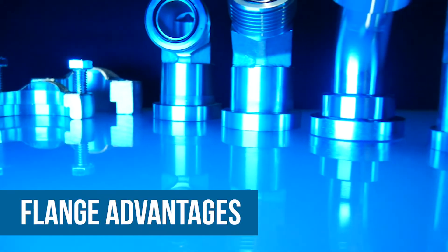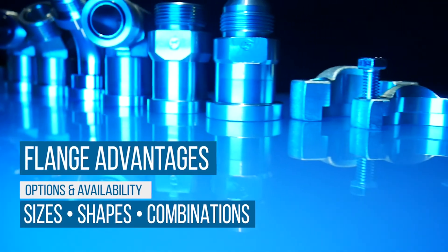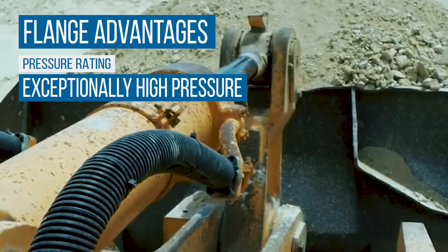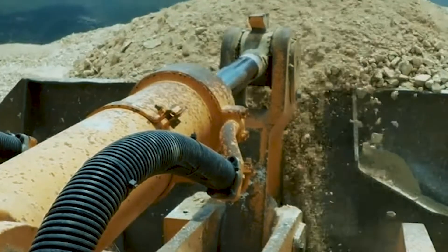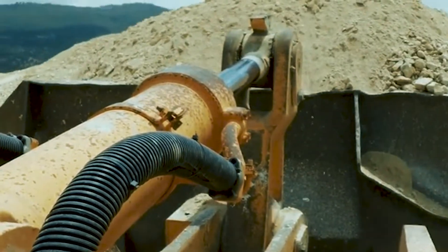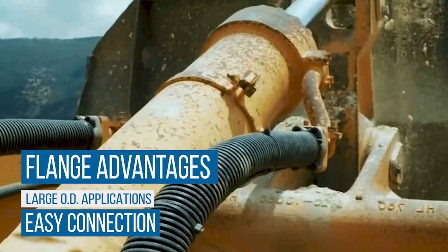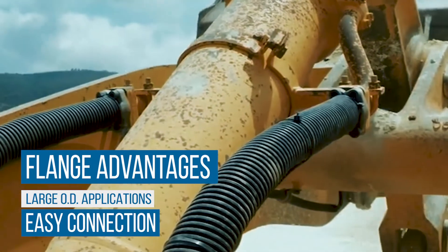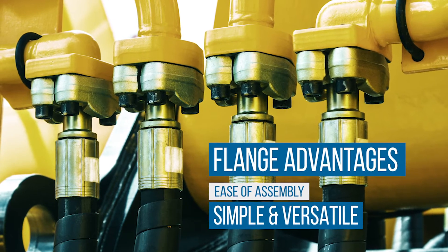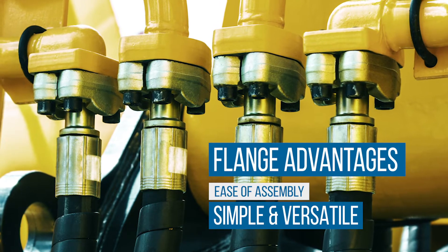However, there are many advantages to flanges and flange fittings. They are readily available and offer a large variety of sizes, shapes, combinations, and materials. They're typically used in applications that will encounter exceptionally high pressures. Flanges sometimes provide benefits to the piping system that traditional hydraulic fittings do not. In large OD applications, flanges are often able to be connected to pipe, tube, or hose and component ports more easily than threaded fittings or adapters. Flanged connections can be best for ease of assembly in tight spaces where wrenches might not have the clearance if installing traditional fittings, and they are more easily assembled with moderate torque.